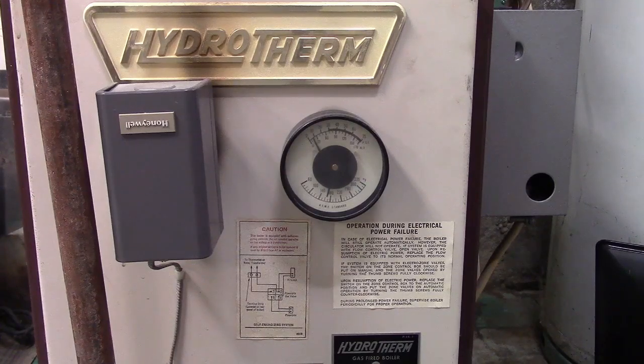We've now reached 40 degrees C on just about all of the pipes. So that's moving up. Pressure, maybe a good 5 by now. I can't see it straight on. Maybe even 6. These operate at fairly low pressure. Temperature has risen. I think the gauges on the pipes end up around 50-ish. 50 something, maybe 55, which a rough guess would be about 140 degrees. That's about right if this goes to 180, 140, so 40 degrees differential temperature in the water, for how accurate these things are just strapped on the pipes with springs, but everything seems to be going well.